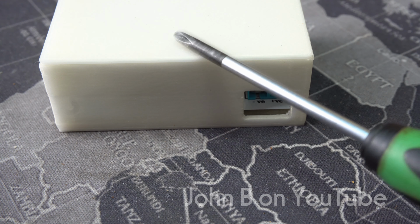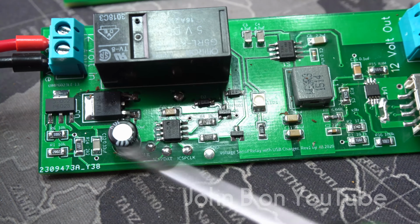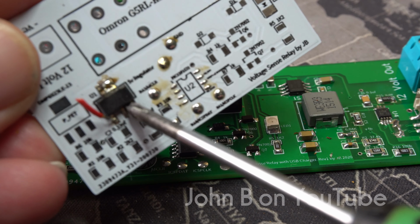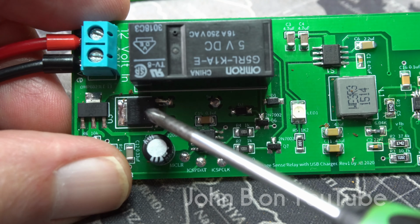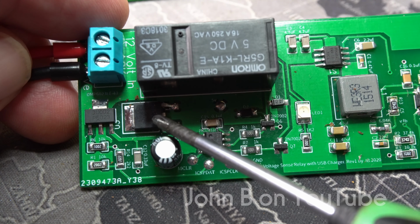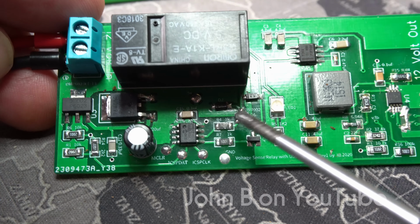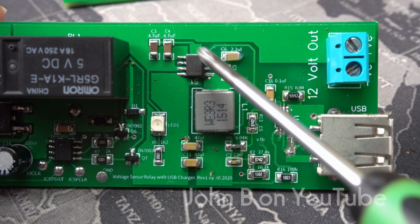But then I thought I still have to mess about with the cigarette lighter socket for the phone, so I thought let's build a USB charger. So this is still the smart relay. Now I've changed to a bigger 5 volt regulator because I'll put the other board in the box now, but this regulator is about 95 pence. This regulator, only half an amp, not 1 amp, is 30 pence, so you get a third of the cost. So although it's bigger, it's a third of the price. So protection FET, stop you destroying it wiring up back to front. 5 volt regulator, same PIC microcontroller, 2 diodes for the 2 coils, 2 transistors, or 2 FETs, LED to tell you when it's on. This is Texas Instruments buck regulator.